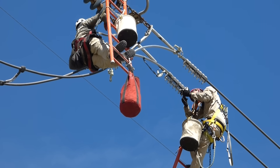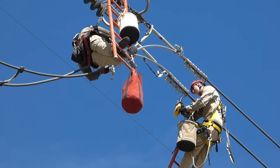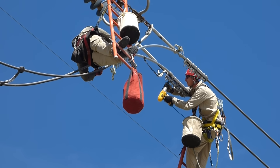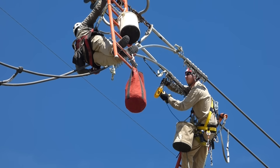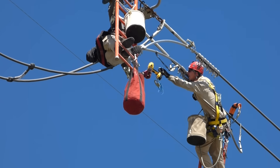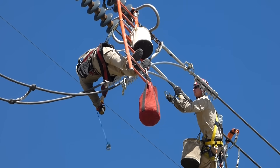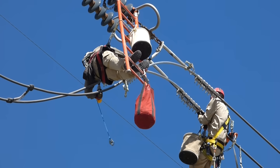Clampstars are also available to handle overhead shield wire and gunshot damaged conductor. Clampstar provides a life extension solution for virtually all overhead conductors. It's important to note that optional safety link tethers are available for dead end and suspension clamp applications requiring full mechanical integrity. Safety link tethers are steel cables with threaded rods attached to each end, which are inserted into receivers on brackets — one attached to the steel eye component of the dead end and the other attached to the Clampstar.